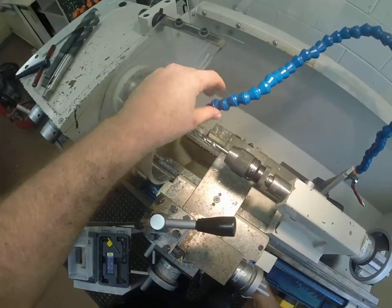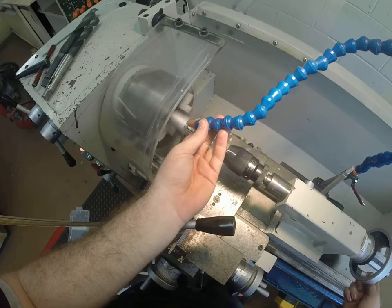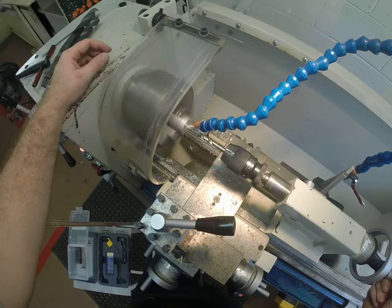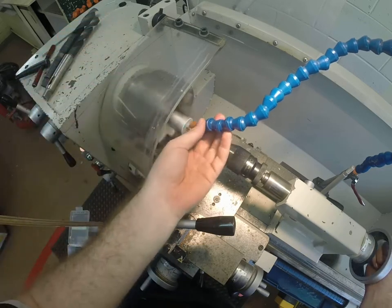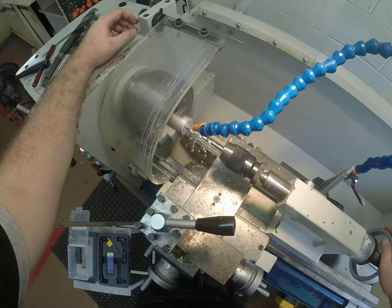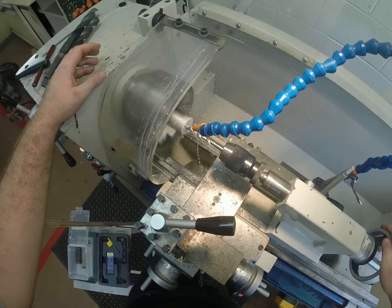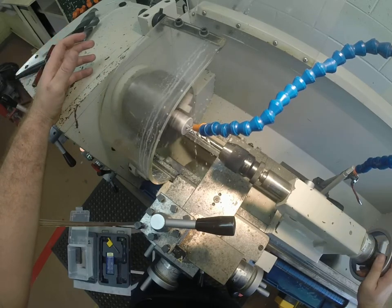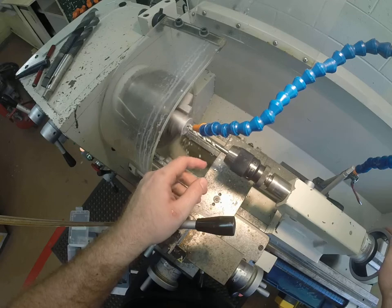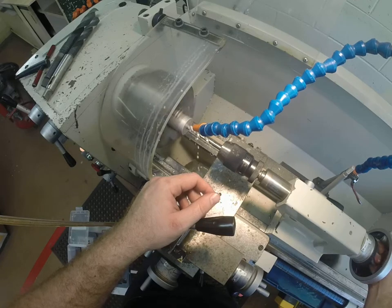On, forwards, cooling on. Now we can start drilling. Now that swarf that's coming out — don't ever grab that. It's razor sharp and extremely hot. When you're drilling through this, you just need to feel the speed that you need to go, because if you push it too hard it'll start squealing and it won't drill very well. It'll just burn our drill bit out. If that swarf stops coming out, you need to back your drill bit out, let it clear off in the coolant, and go in again. This is a process called peck drilling.